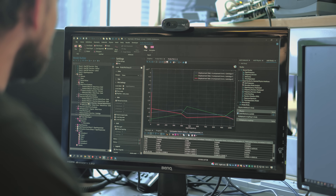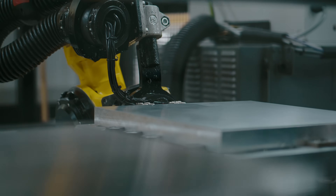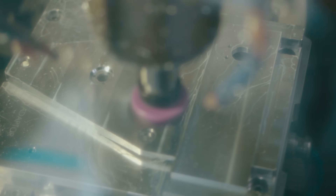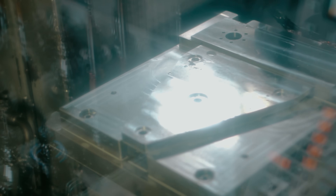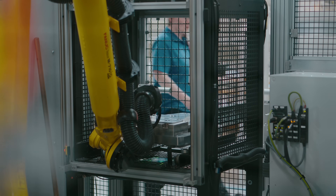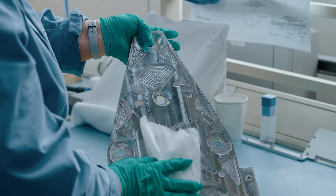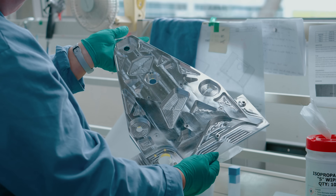Sounds simple enough, but the result that came out of the optimisation was wild — it was unmanufacturable. So this was really where the hands-on engineering started. We sat down, design and our manufacturing engineering team, to look at what had come out of our heuristic optimisation and decide which were the best bits that could be manufactured. We needed to produce something that was going to be manufacturable repeatably and reliably with a high degree of accuracy. We took the best bits of the optimisation, we machined a sub-chassis, and off the machine we analysed it with a laser interferometer to check the vibration across the surface.